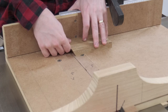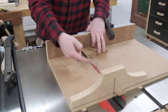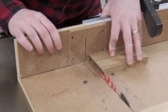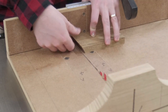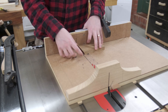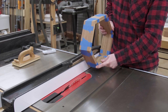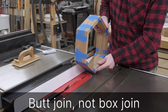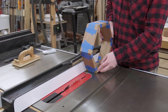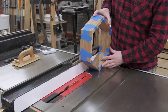If you're happy with visible joinery, probably the easiest way is to cut a spline joint — with the blade still tilted to 30 degrees, line up your pieces and cut a thin groove. That groove can then be filled with a piece of wood, providing a long grain to long grain connection between the two pieces. Another option is the humble key: once you glue up the hex, even with just butt joins, wait for it to dry, run it through for a partial cut through each join, and plug those key slots with a key. They can also be contrasting timbers, and you typically use a jig to hold everything square and safely.